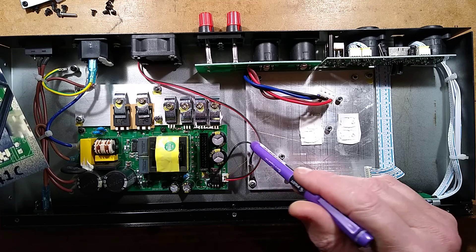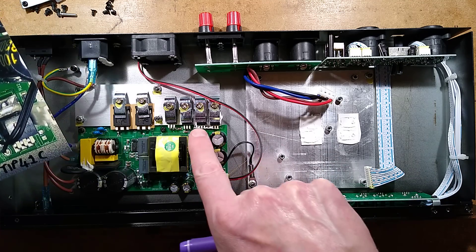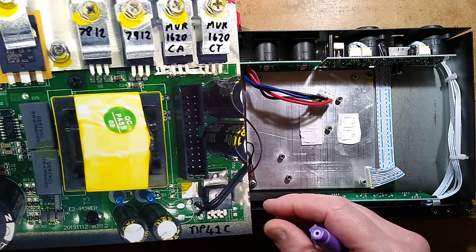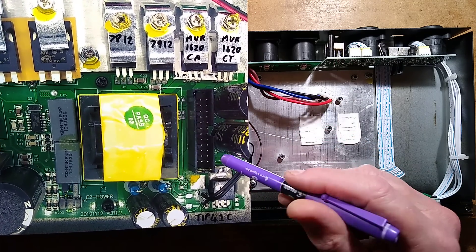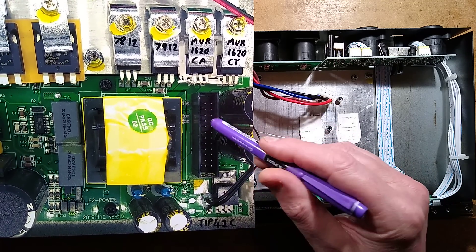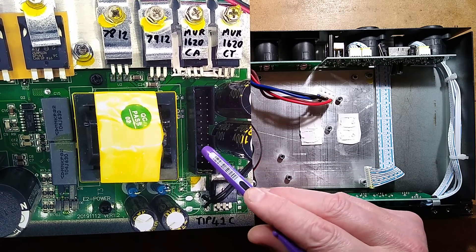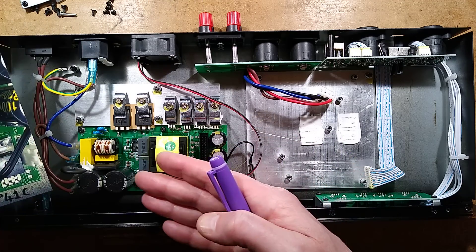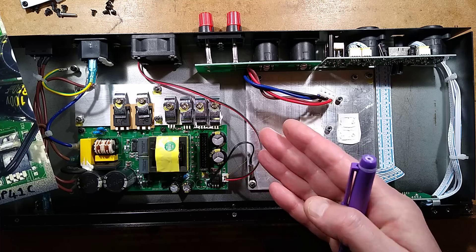There's also a temperature sensor going from here onto the heatsink plate for the amplifier — presumably if that gets too hot it signals back. There is a ribbon cable going from this section to the amplifier board. That's not just carrying power — it's carrying signals. The pins are clustered as sets of six: plus supply on six, minus supply on six, ground on six, and then six control and signal pins for indicating when it's powered up, stabilized, over temperature, and other things.